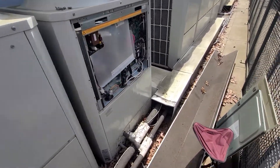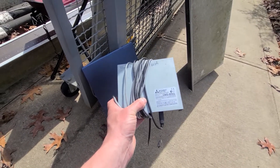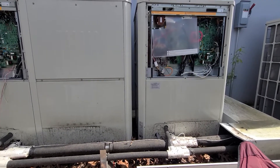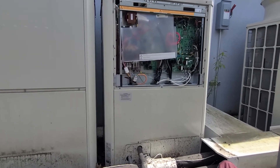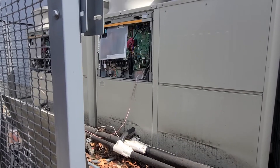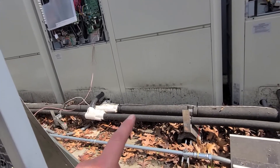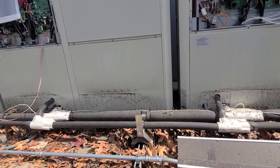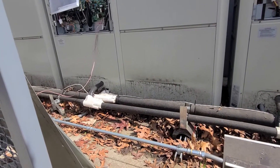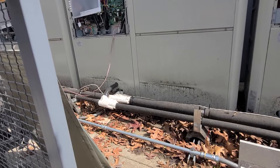I'm using the CMS MNG E maintenance tool — it's the older version, but I keep it on my truck. I'll come back and run a new wire. Now that I've seen that wire all burred up, I'm going to check all my jumpers between the outdoor units too. I think it was a piece of wire that got run against a sharp metal edge, nicking it all the way down — though rodents are always something to watch for as well.